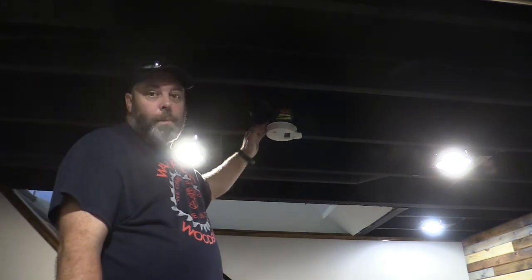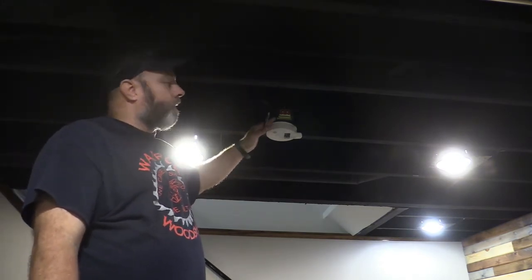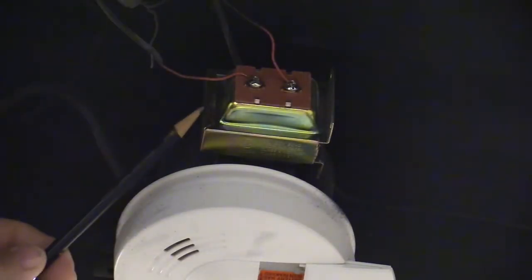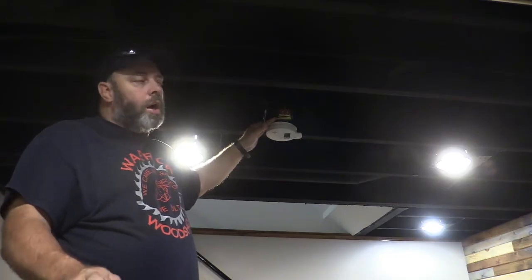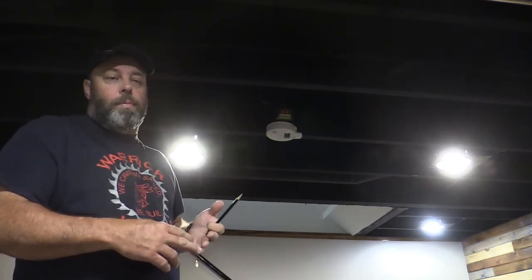Before you actually purchase your Ring Doorbell camera, you might want to find this little gizmo somewhere in your basement, house, garage, or near the electrical panel. This is what's called a transformer. It takes the 110-volt power that goes into this box for the smoke detector and converts it down to — in our case — 16 volts. If you have one of these, make sure it is the correct voltage, which is labeled between the two screws. Some will be 8 or 10 volts; some have three screws for optional 8, 16, or 24 volts. The Ring Doorbell Pro requires 16 volts, and this one already is a 16-volt transformer. If you see one with three screws, pay attention because how you hook it up will determine what voltage it produces.